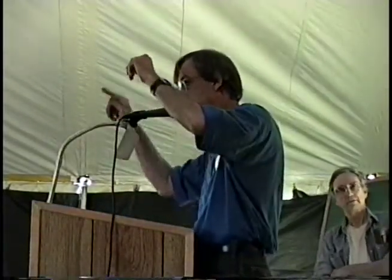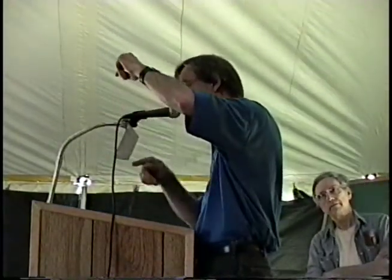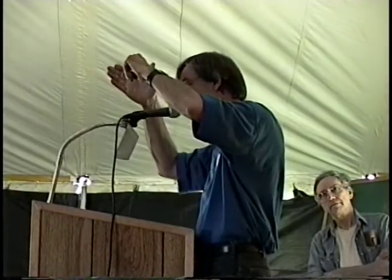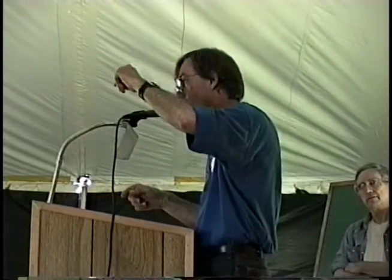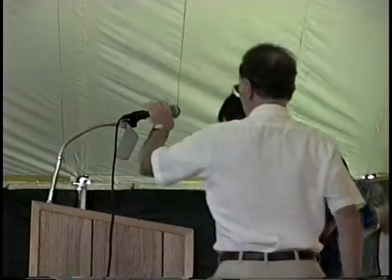That is, the difference between a round nose on a streamlined body as compared to a flat nose, as long as the corners are rounded, there's no difference in drag so long as the wetted areas are the same. Is that correct? And providing that the flat face, that disc diameter, is not more than about 50. This is a very interesting thing here. Bruce should elaborate a little bit.